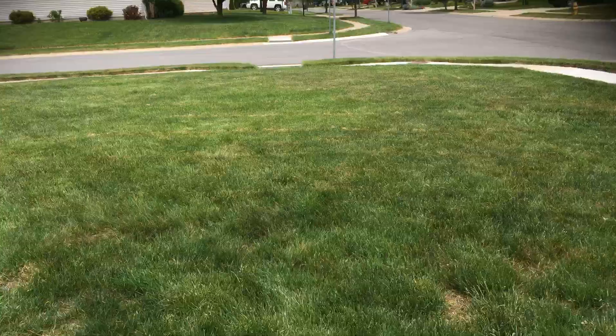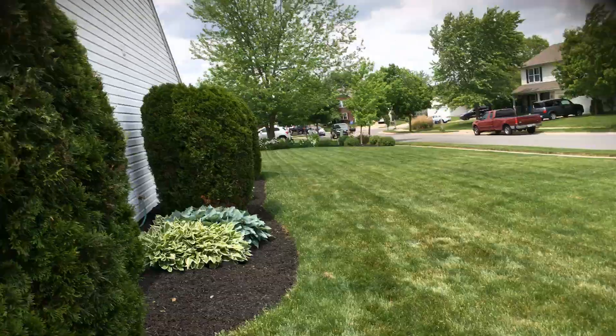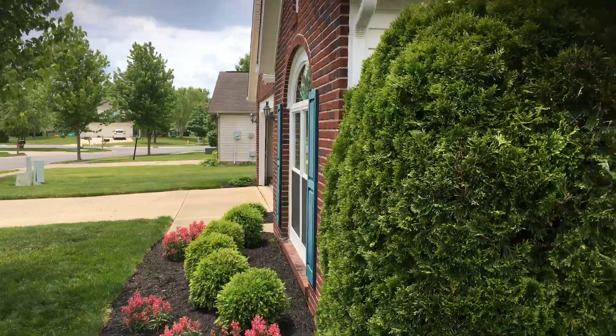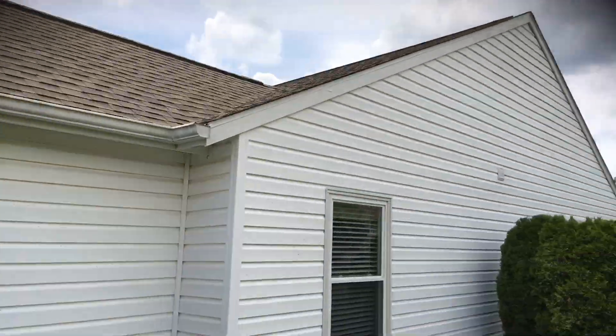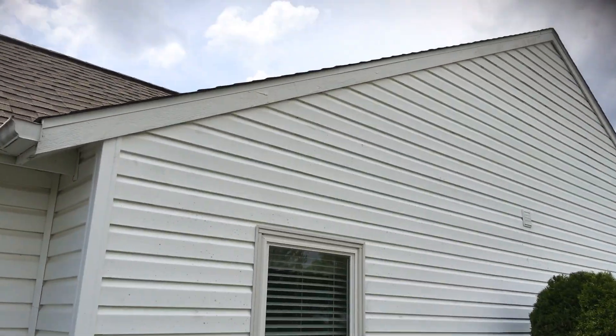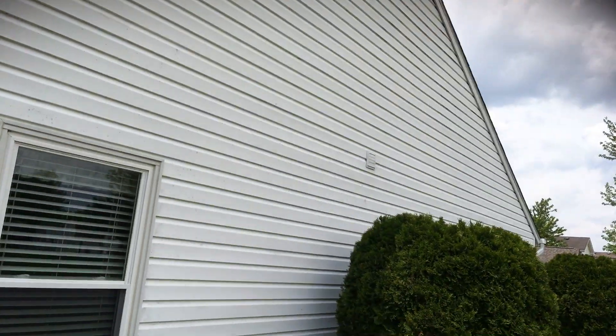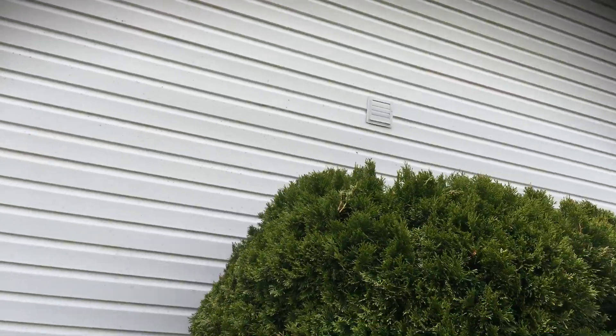This side over here — shutters will come off, so nothing with the shutters. You've got the trim work here with some peeling at various locations along this fascia, so we need to scrape it and prime it with peel bond to make sure adhesion is as best as possible.